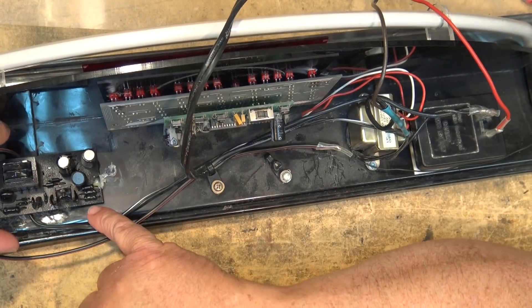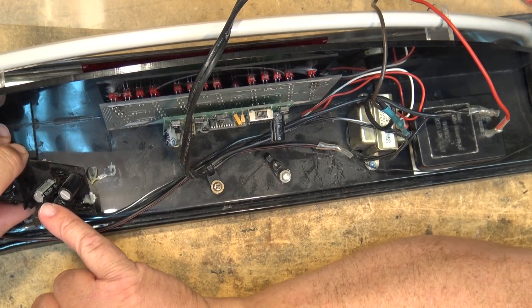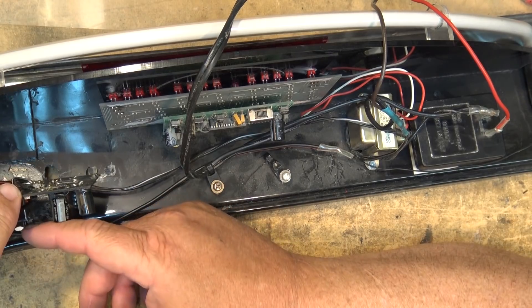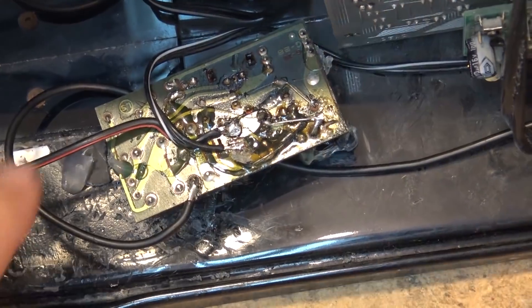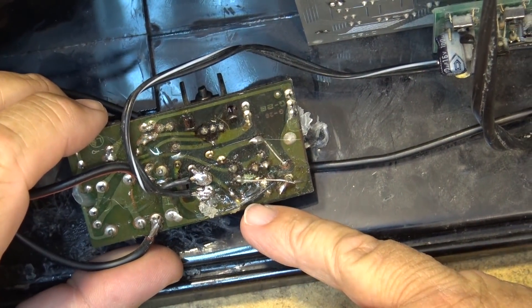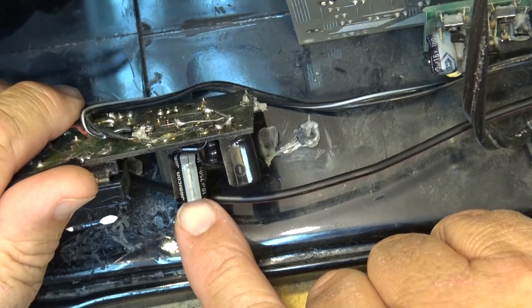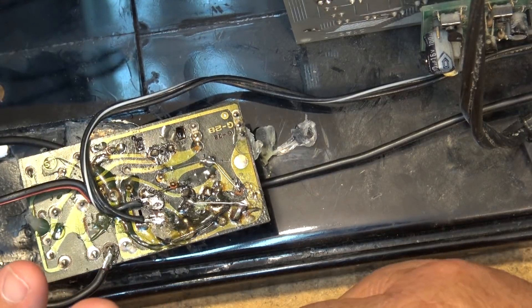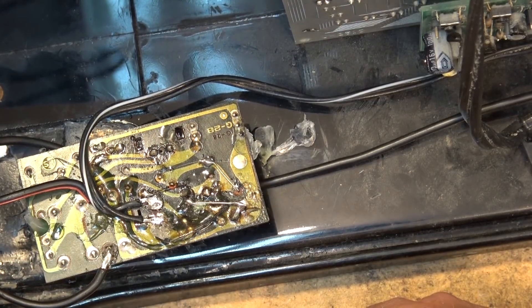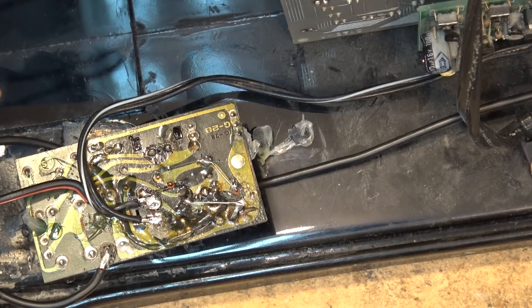What I've got to do is repair this inverter — there are only a couple of capacitors on here. It's probably going to be this one: the 10 microfarad 250 volt is likely the one that's gone bad. You can see what happened to this inverter board one time when it failed — it burned up pretty good, so I had to repair it; traces and stuff broke on it. Anyway, I'm sure this is the cap that's bad. We can verify that with the ESR meter to confirm the ESR has in fact gone up on this thing.